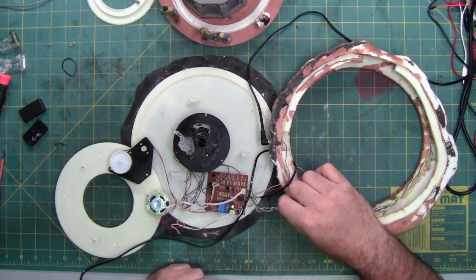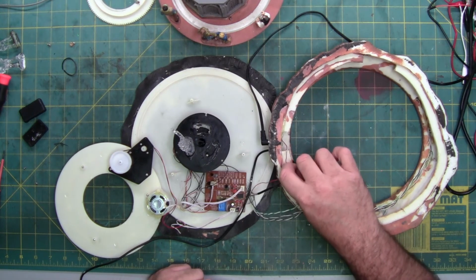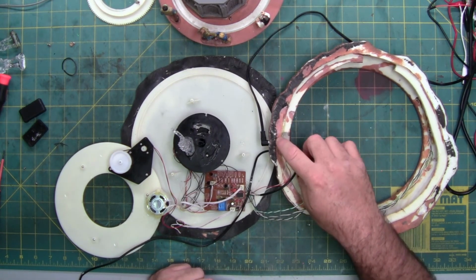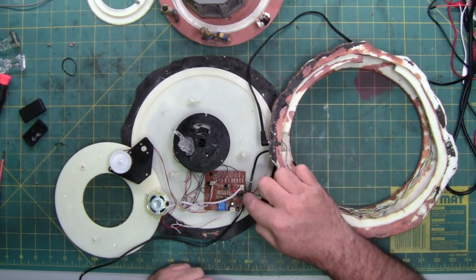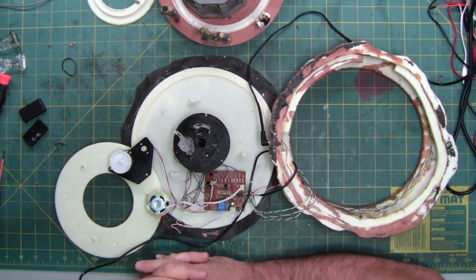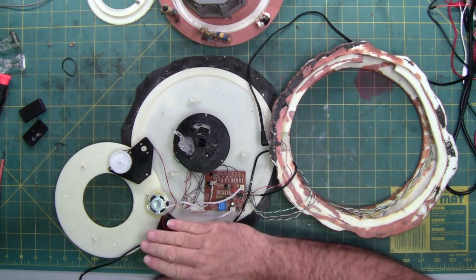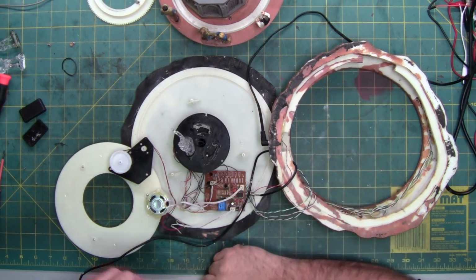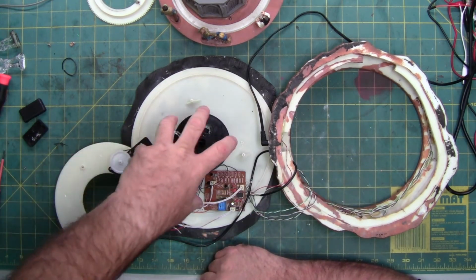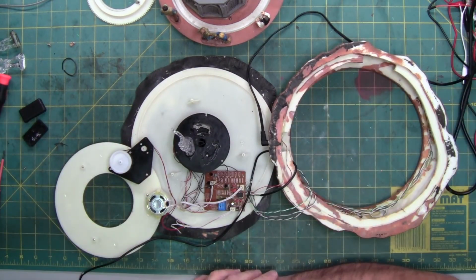So these right here are probably twice as thick, much thicker gauge. And of course this cable has strain relief, so you're not going to damage it going through the base, but you can rip the 5 wires off at the bottom of that circuit board. And then you're going to have a bad day again. So careful when you do it. Just peel it slowly, flop it over as you saw, remove those 3 inner screws after you pull the hub out, and just slowly disassemble and stack it.